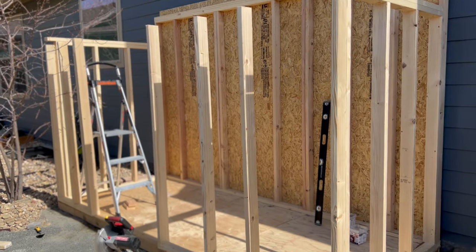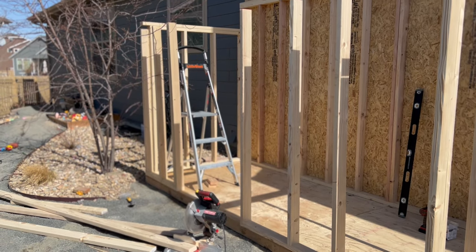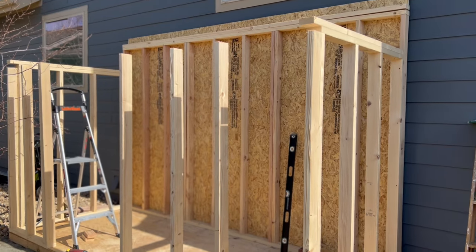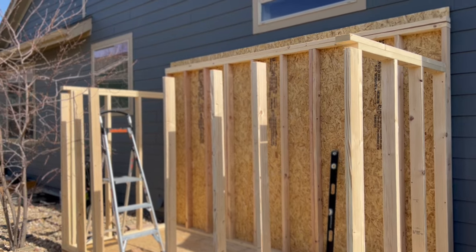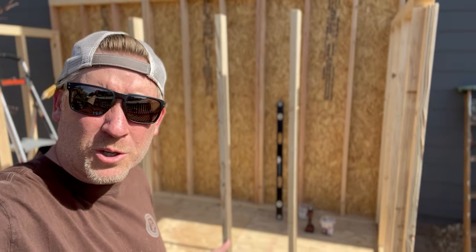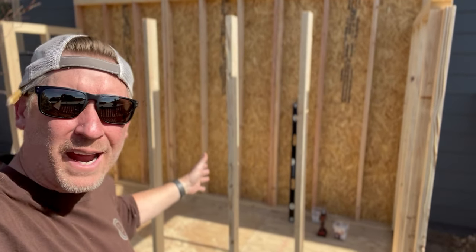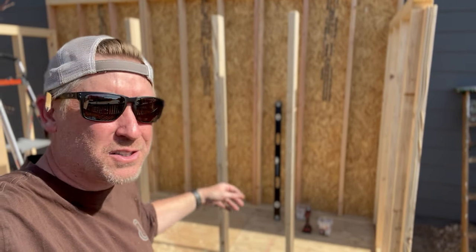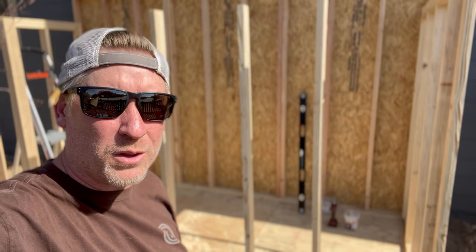Sidewalls have been put up and now I'm working on this front wall. I wanted to show you something — because there's a door, I built the far wall, stood it up, screwed it into the sidewall, then built this wall over here and stood it up and screwed it in. So now they are secure. I'm going to bring the top plate and put that on, then put the second top plate on as well. You'll notice this wall has considerable spacing on each side — that's because I bought a window and wanted it centered on this wall. They're just slightly wider than 16 inches. It's a shed, not going to have a lot of weight bearing on this part of the wall, so it should be good to go.